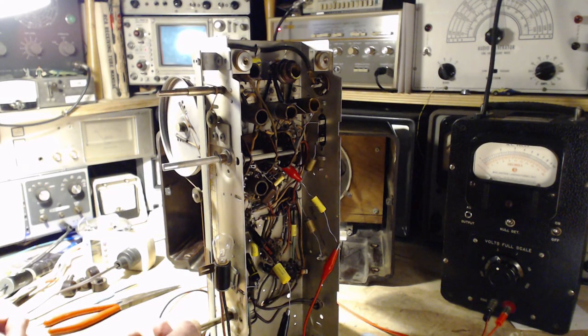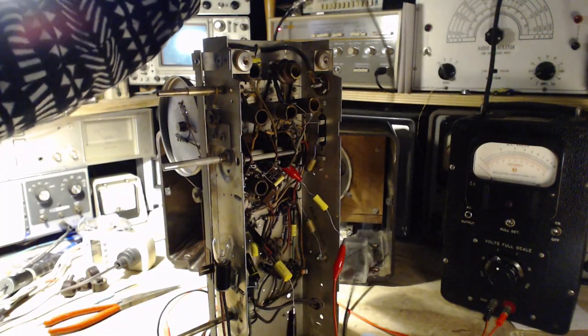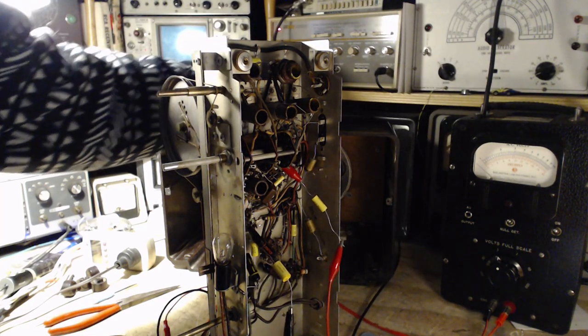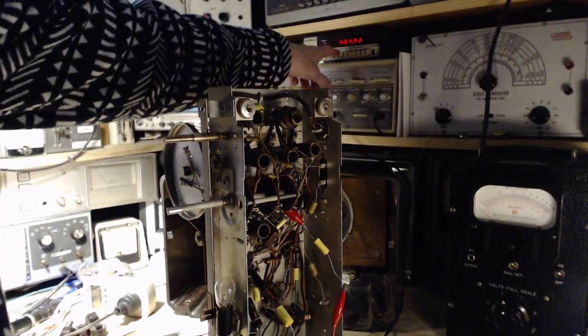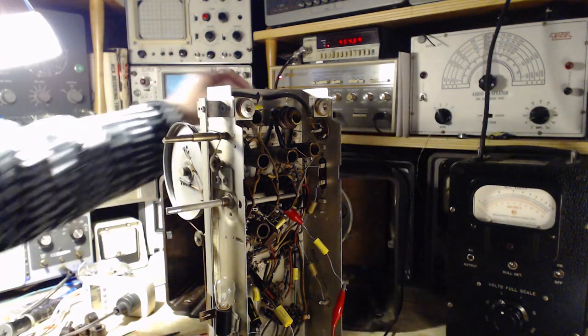Okay, so first thing to do here is to change signal generators. So I'm going to take the connection here and put it on a different signal generator. This signal generator has the ability to sweep through the frequencies I'm interested in. Still have capacitor protection on all things. And I have the frequency of this set to 455. One thing about this guy is no modulation. So if I tune it around a little bit,